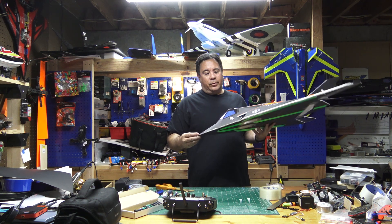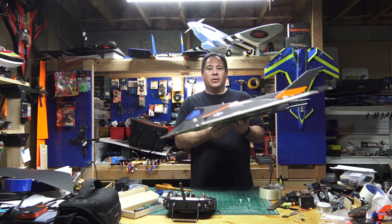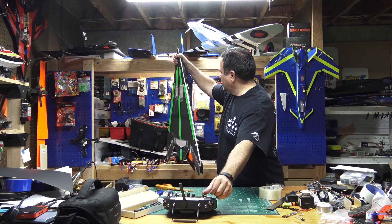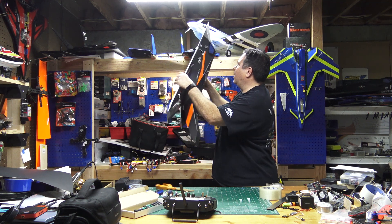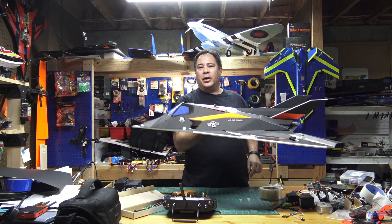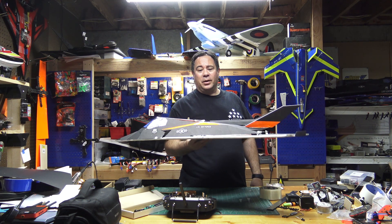I got the plane all finished for the most part — cut out the air ducts for more air in, put some tiny cheater holes on the top lid, and closed up the bottom ones. I did a thrust test with a fully charged battery and it came in right at about one-to-one, which shows it's getting enough air through the air ducts. Hopefully that'll be enough to fly it. We'll probably have to wait till the next video because the weather's pretty bad with rain right now — stay tuned, I'll get out the test flight as soon as I can.